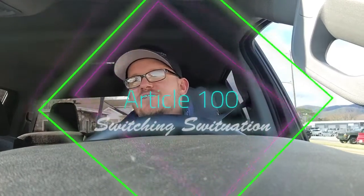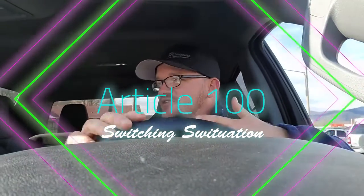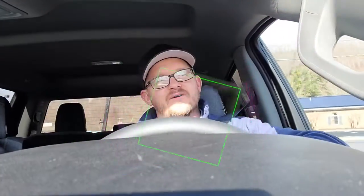We're heading to a customer's house — a dear customer who does a little electrical himself. He got into a three-way switch situation, changed the switches out, and now it only works when one of them is up or down. Typically, if one switch works and the other won't, or neither works depending on position, it means either the switch leg or the power in is mixed up and on the wrong screw. It's usually a pretty easy fix. He also has an exterior light he wants us to hang.